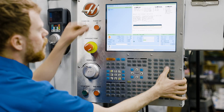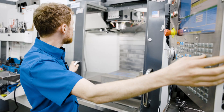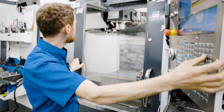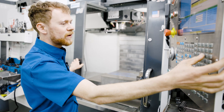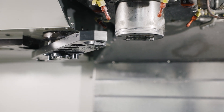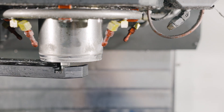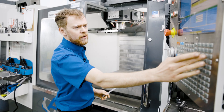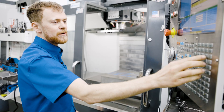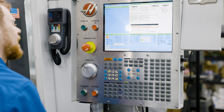I'm going to push the ATC forward button until the arm comes around and engages with the spindle. The spindle needs to be at the home position while this is done or the double arm will run into it. So I'm pressing ATC forward and the double arm is going towards the spindle. I don't want to go too far because then the dogs will hit. I'm going to continue to hit forward until looking at the outputs I see where it says arm and clamp unclamp.